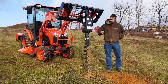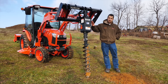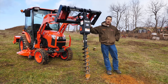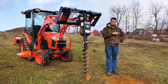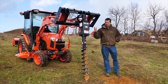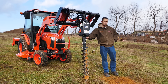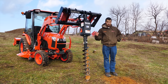You see running that, the flighting on this doesn't spin super fast, and that is the speed even with a lower-flow motor. Keep in mind, if you're setting your tractor up to do this, you definitely want to get one that has the proper hydraulic flow motor. Even if you find a used skid steer model out there, it's not necessarily a great idea to try to pin it onto a tractor like this and have a go at it. Generally, if you have enough hydraulic pressure you should be able to get enough torque to spin it, but the flighting is going to go super slow and you're not going to be really productive or efficient with it at all.